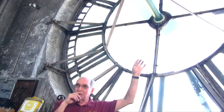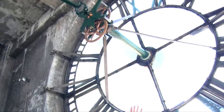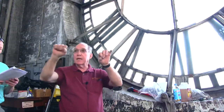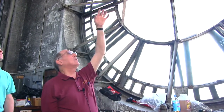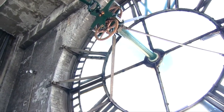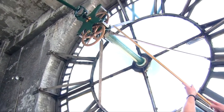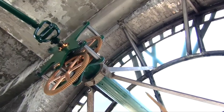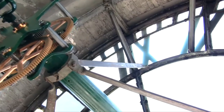This is called motion work — your dial gears, you might hear me say. Your dial gears have to be oiled at a given period of time. Originally, there was an oil port at the hour wheel with a tube sticking out. We changed that to a flexible tube. When oil was put in that tube, it was expected to run all the way through the hour tube to the end and oil the minute shaft. Do you think that happened? By the time the oil got to the end, it was gummy and plugged up the holes — so you were never oiling the outer bearings. Never got there.